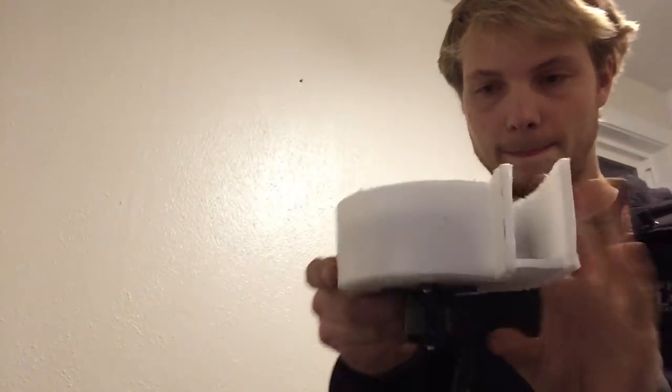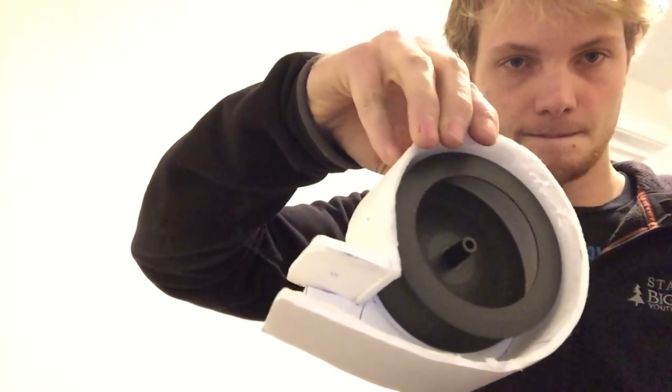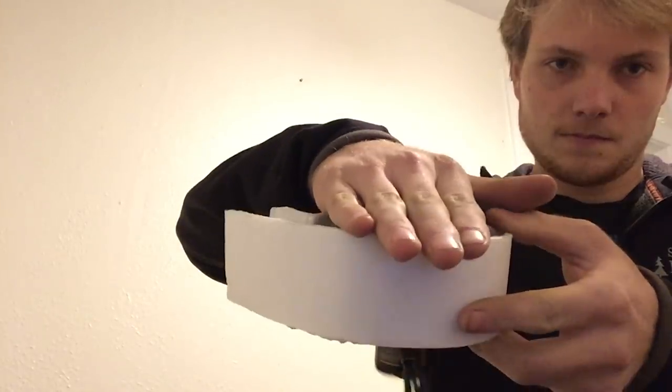Then I just cut a hole in the center as an intake port. The way this works is that the spinning vanes in the impeller make the air spin too, flinging it out like children on a merry-go-round. The air moving outward sucks more air into the center of the impeller and discharges pressurized air at high velocity out of the discharge port, and it works pretty good.